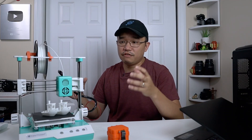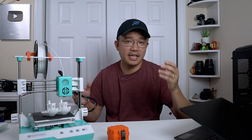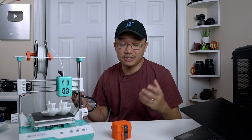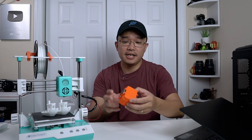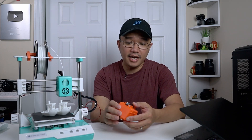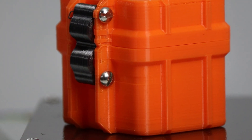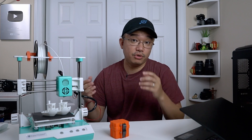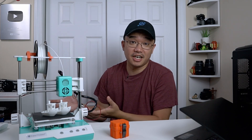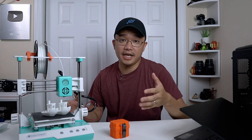A couple of weeks ago I reviewed this ultra affordable $79 3D printer — now around $80 on Amazon, link in the description below. I was thoroughly impressed on how well it printed this Pelican case, though there were some minor defects at stock settings. You can notice either it's under-extruding or the retraction settings are wrong, causing these little hiccups on the side. It still printed what I needed and did a pretty good job for a $79 printer. In that video I also mentioned calibrating it to get the best print possible, and that's what this is all about.